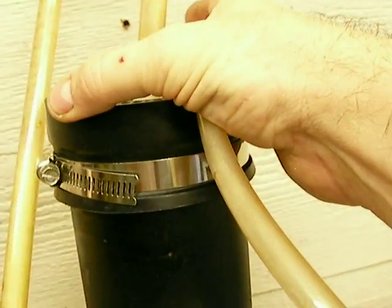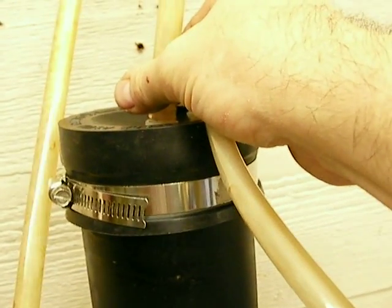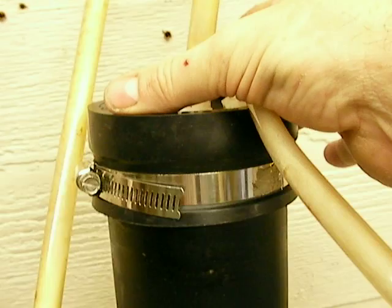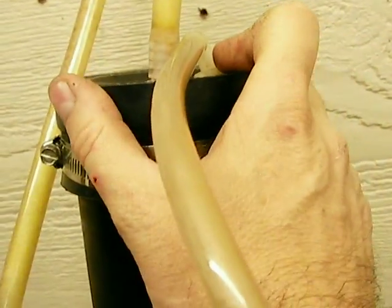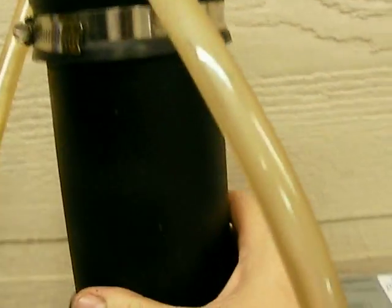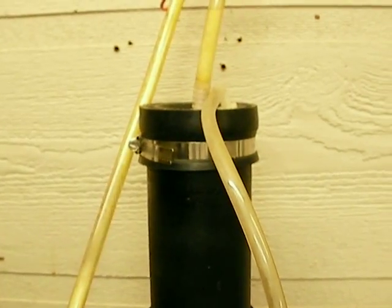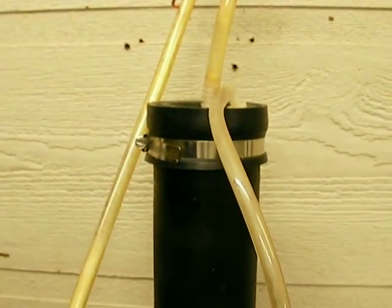It's a great safety feature. I don't like using the screw-on metal tops — they come off at 65 psi but they're very violent when they fly; they can actually take out a car window or put a dent in the hood. And I don't like using PVC screw-on tops because I've run those as high as 100 psi and when they come off it's ugly. That's why I use the rubber ones — they're safe. I use them on the bubbler, the reservoirs, any PVC container I'm using for hydrogen.